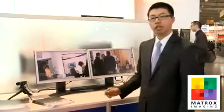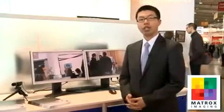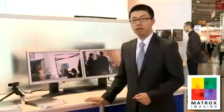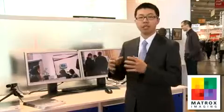Now I'd like to show you our second demo, available here at Vision 2010. The hardware here is the Matrox Orion HD, an HD/SD capable graphics adapter and grabber board that we have on display. This card is capable of accepting DVI, SDI, or even an HDMI or VGA adapter, for display or input. Acceptable formats for input and output are up to 1080p at 60 frames per second.